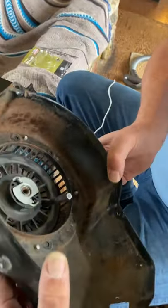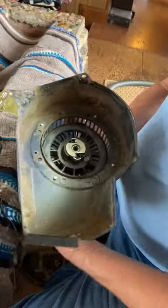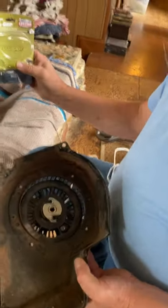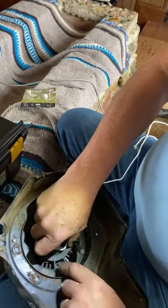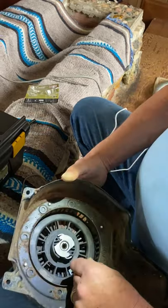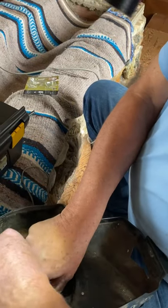On the opposite side of the hole is where your spool, where your spring is, right there. There's a little hole, and the instructions on the pack tell you to stick the cord through there and then try to feed it through that hole. Well, what I found out was: don't do that. Feed it through this hole from the other direction.